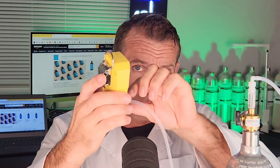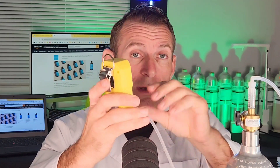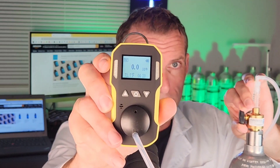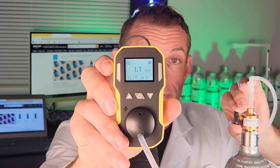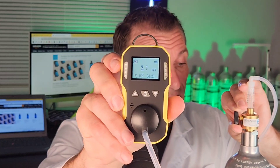Make sure you don't regularly detect it like this — this cap is only used when you're calibrating or forcing gas to the sensor. Now we're going to expose it to some phosphine gas. We're in a well-ventilated space. You're going to see the numbers slowly going up, climbing as it's detecting the phosphine gas molecules.